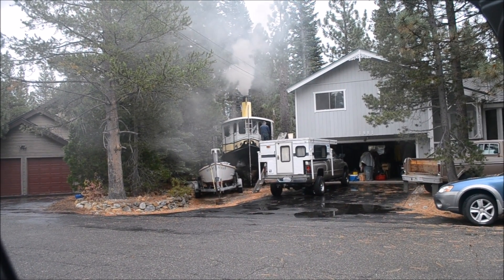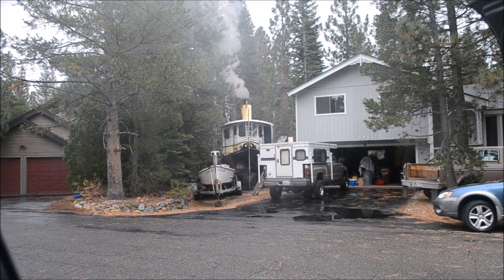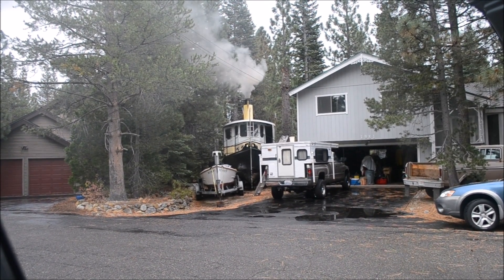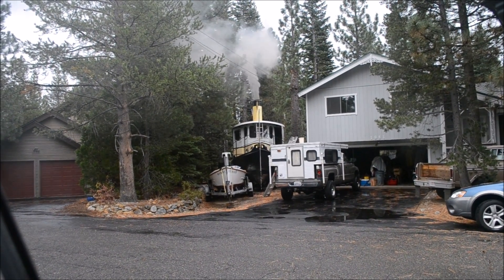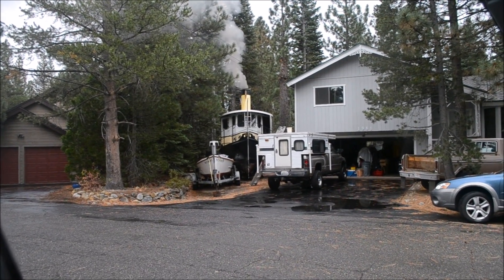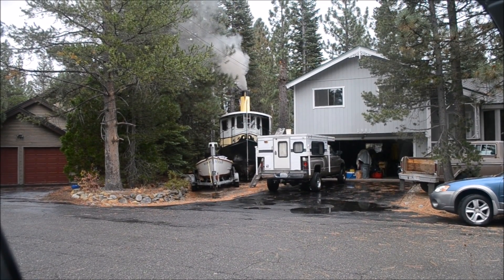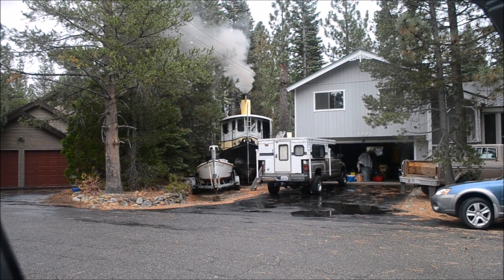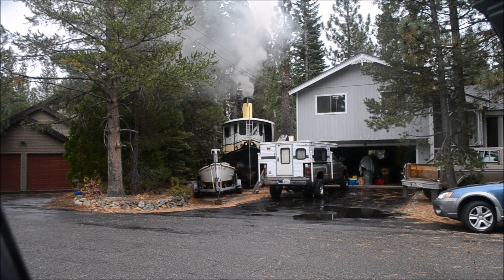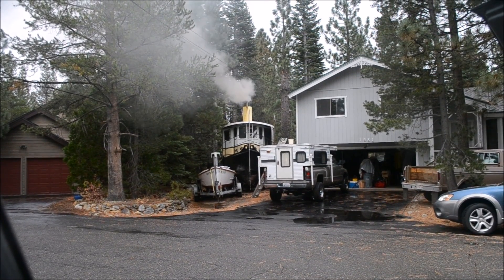October 1st, 2015. It's a nice rainy day. We're doing our first real steam-up with strictly wood, or at least to get steam up. A lot of wet wood, unfortunately. But we're about 10 minutes into it and we're already getting a little bit of steam out of the top blowdown of the boiler. A very big firebox — a nice dry, clean wood fire would mean a lot less smoke and probably a lot faster steaming.